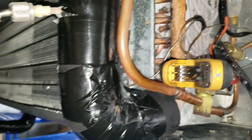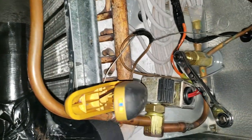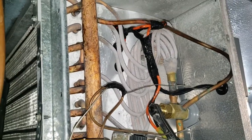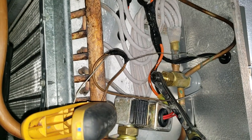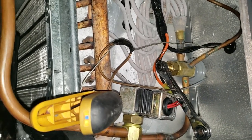Wire-tying the bulb up here and then getting it running again. We've got our port here so we can actually check our superheat. We've actually had to make a couple of adjustments. When it's all said and done, we ended up having to pull the charge because we had non-condensibles in it. We had to take the TXV apart and clean the two push rods that are inside there, then readjust everything.